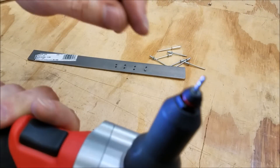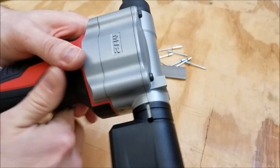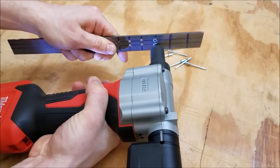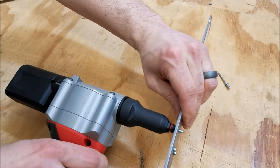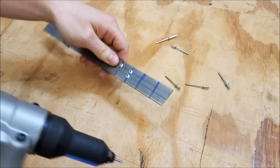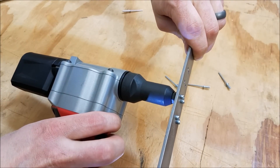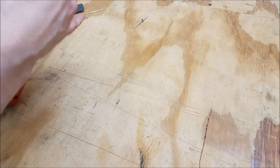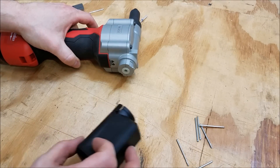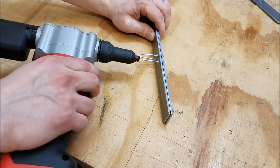It's pretty fast. You've got the mandrel still here — you can tilt it back and when you put the next one in it'll fall back into the mandrel catcher. Here I've got two eighth-inch thick pieces of steel with quarter-inch grip rivets, one-eighth inch diameter stainless steel, so I'll demonstrate riveting actual material.